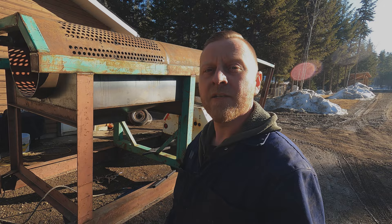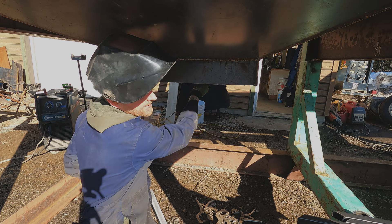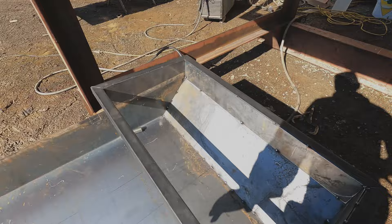Let's get at it. I'll start off with this section — I'll be doing a small flare from two feet wide to three feet wide. To start off I want to make this area really rigid, so I cut out some inch-and-a-half piping and we'll weld this all the way around. With the perimeter structure all welded up, I went ahead and made this sluice box and also welded a perimeter around it so it stiffens up.